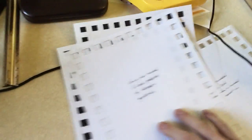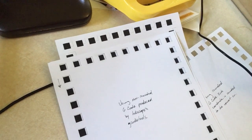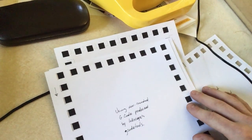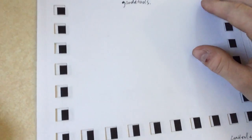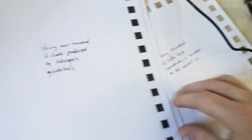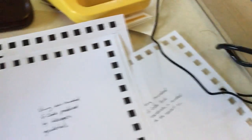So let's see how this one fares. Let's line it up on our image. It's better than M-Laser because it cut out the squares completely. But as you can see, it still is off by a pretty consistent factor — the further you get away from one of the corners, the worse it gets. So that leads me to believe it's a scaling issue — maybe it's translating things, making it slightly bigger than it should be.